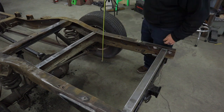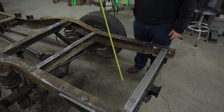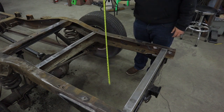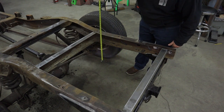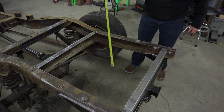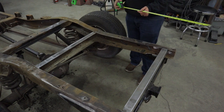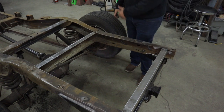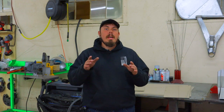Before I forget — depth. Depth was kind of a guesstimation. Since this is not an off-road vehicle, just street only, we decided to go 11 inches down in the rear and 9 or 10 inches up front. So we got a 1-inch drop from front to rear, which makes it very likely to drain the fuel into where the pickup tube is. Once you have all your numbers written down, you have a rough idea of where everything needs to go. It's all about creativity — do the best that you can at your own game.